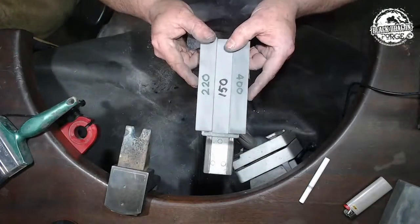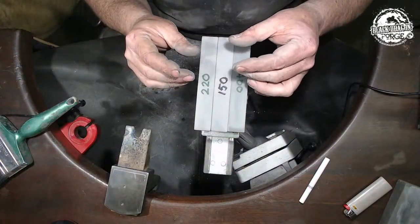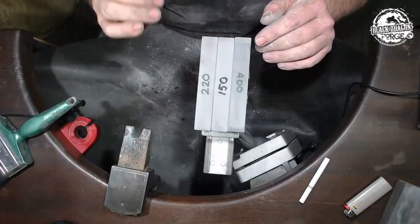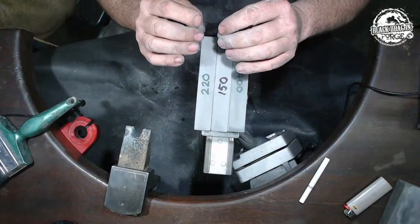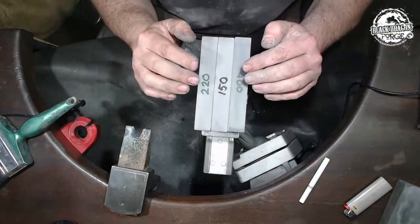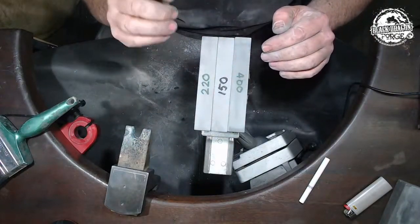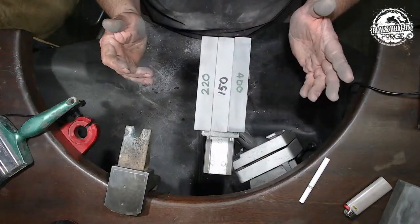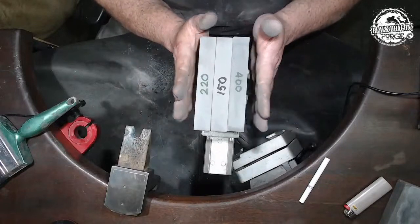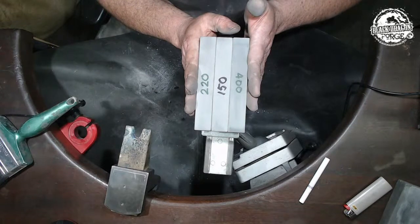They don't get used very often, but on, for instance, ricassos, I use that on any funky, fancy grinding, on tips of blades, where I just need to hone something to get it absolutely perfect. Plungers, if I'm doing 90-degree plungers, I won't use these. I actually have another set that is cut at 45 degrees, and I find that works really well. But done. So I'm getting these ready. The last time I really used them extensively was 3 years ago when I did the main gouge build.